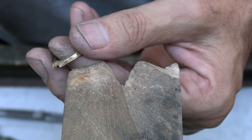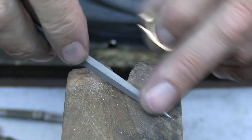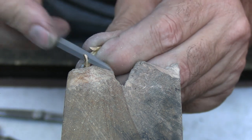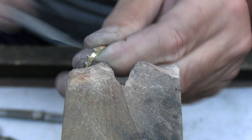Now do the fine tuning with your needle files — you'll find the barrette file is a really handy one to use for this because it's got no teeth on the back, so you can tidy up the bottom parts of the shoulder.